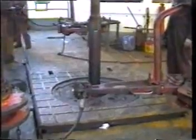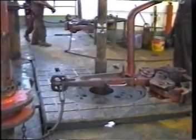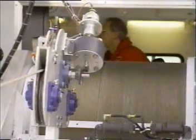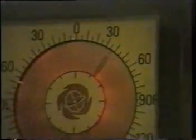If the concave has to be oriented in a particular direction, the assembly is lowered to approximately 20 feet above the bridge plug. At this point, a wire line with a gyro is run in the work string until the mule shoe sub has been reached. Readings are taken to determine which way the concave is facing.